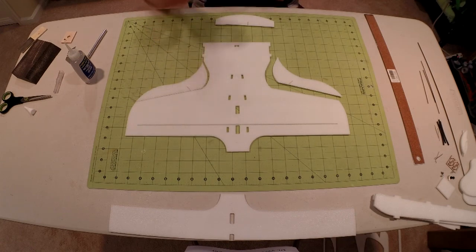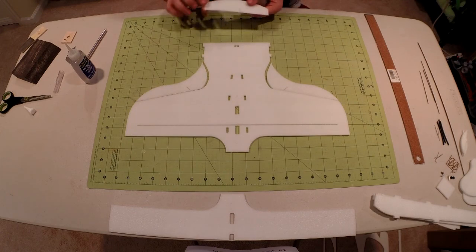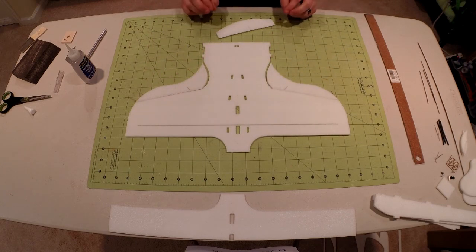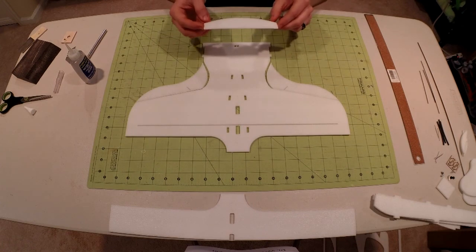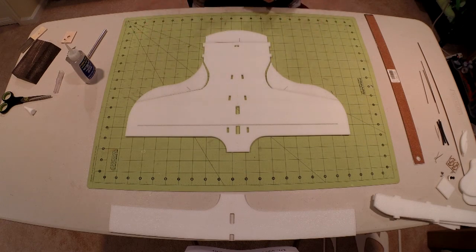So now we're going to take our Blenderm hinge tape and our control surfaces that we've beveled in the last step. We'll just line them up by eye, just to make sure that everything looks right. The ailerons, you'll be able to line them up with the curve of the main wing into the aileron. There's plenty of room on the inside, so there should be no issues with contacting the main wing on the deflection. With the elevator, since it really could go in either direction, but with our bevel, it locks in the direction we're going. We've machined a very small notch perfectly in the center of the surface. That centered notch will line up with that seam of the two halves of the wing. Since that's right down the center, it'll be a perfect alignment, and you won't have any issues once we install the vertical stabilizers.